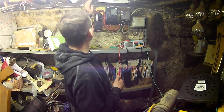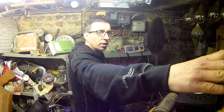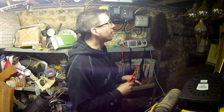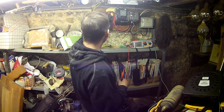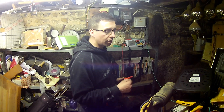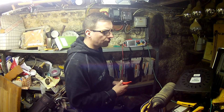We've now run our water bond, which goes all the way back through into the kitchen — that's where the water main actually enters the property. We've connected our bond to there and run our cable all the way back to our MET. We're going to test that again just to make sure we've got a good bond attached to the copper pipe, which we also cleaned with some cleaning strip.